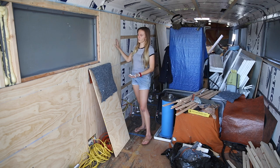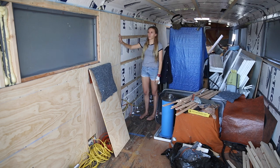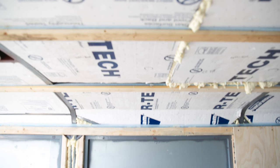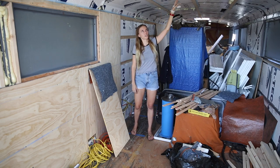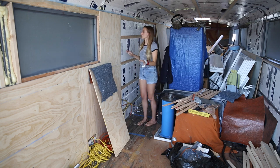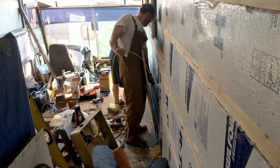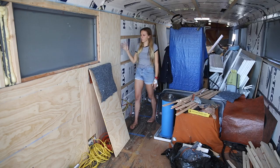What we've done with the walls is probably the most exciting thing — we have a wall now. You can tell in the ceiling what it used to look like before: we had our first layer of insulation and the runners. What we did differently here is adding a second layer of three-quarter inch insulation, so now everything is flush with the runners.